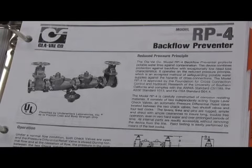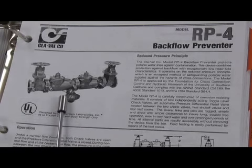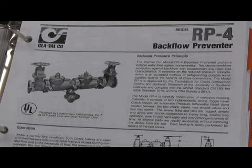But the RP4 was different than the RP1 in that it utilized a new style of check mechanism called the 3084 toggle lever check, and it utilized a new type of relief valve called a CDHS-24 relief valve. Externally, there was no difference between the check bodies in the 301 and 3084. The internal parts that were different were the disc retainer, and the disc guide. The CDHS-24 relief valve did appear slightly different on the outside. It had a lower throat on the bottom of the relief valve, which we'll show you on the next picture.